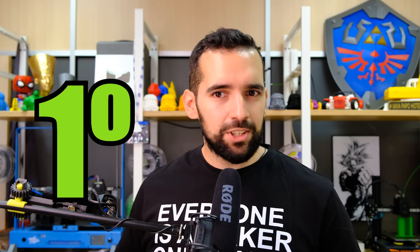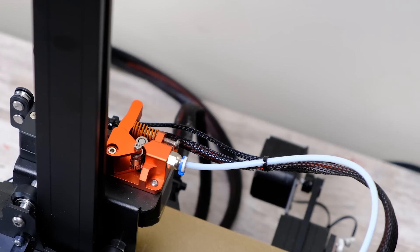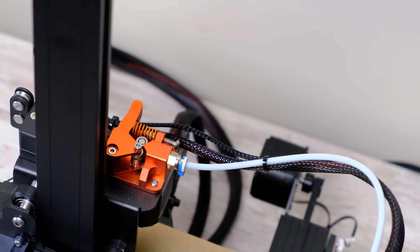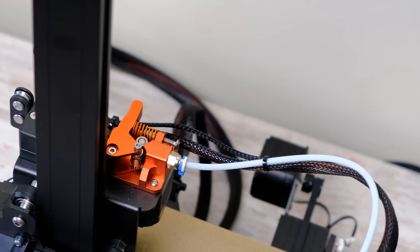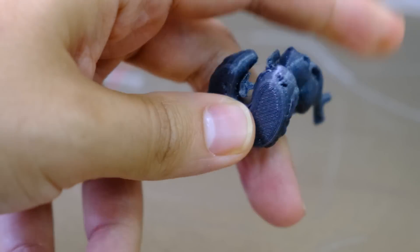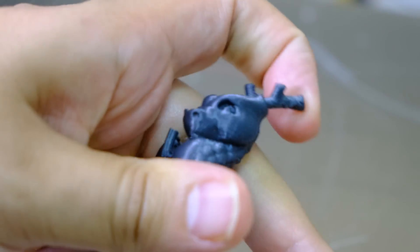Before talking about that, we are going to give its five positive and negative points. First thing I liked: the extruder. Talking about the parallelism that this printer is an Ender 3, one of the worst things the Ender 3 has — either Pro or version 2 — is the stock extruder. In this case, we have a Bowden-type with a dual-drive extruder, meaning it has a double groove for better grip. Not only that, but we also have a pressure regulator, which allows us, among other things, to print with flexible filaments.